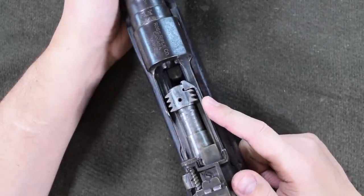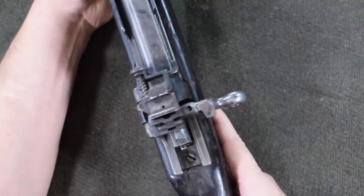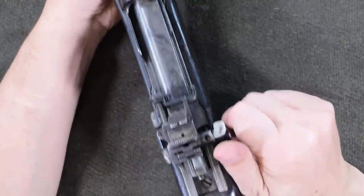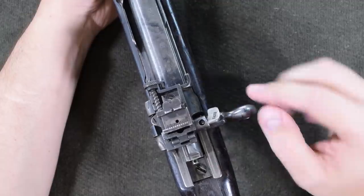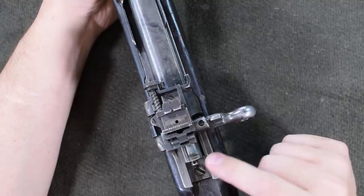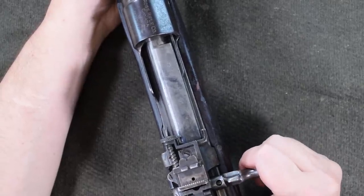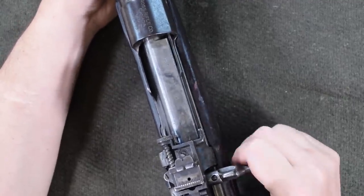I've correctly assembled the bolt so that I can show you a neat little trick. If I close this up, she's just gone into lock, and I can tell she's gone into lock with one handy trick — I can throw the safety. And then if I try to rock the action, she's locked shut. If I go to the mid position, the mid position on this safety means that I still have the cocking piece tied up, but I haven't actually locked all this down. As long as we're still in the mid position, the bolt handle can move, but it does not allow the cocking piece to be in the correct position to rotate the locking lug.